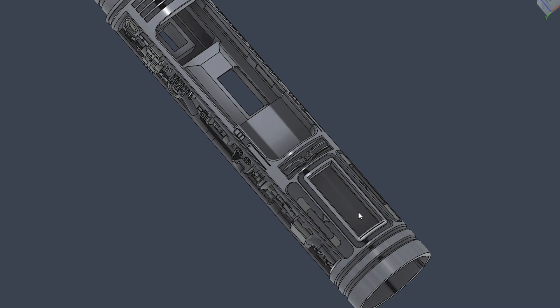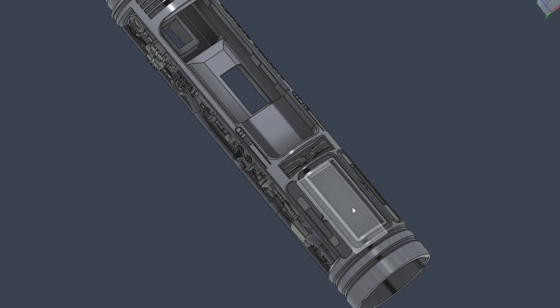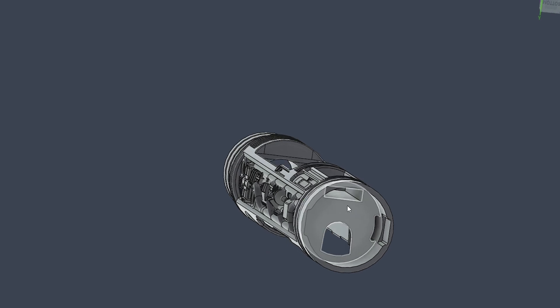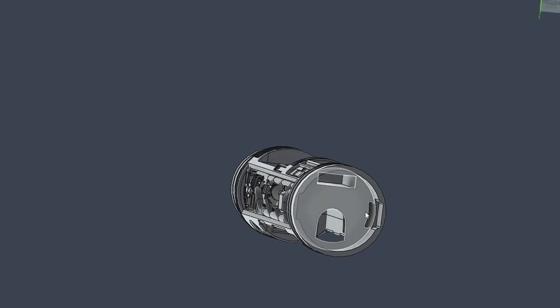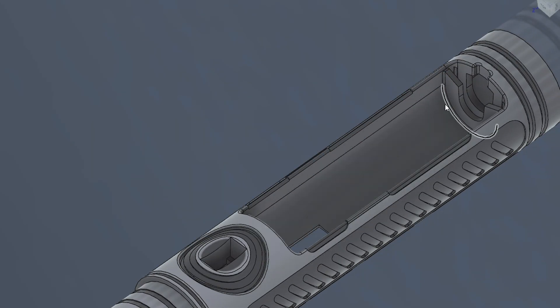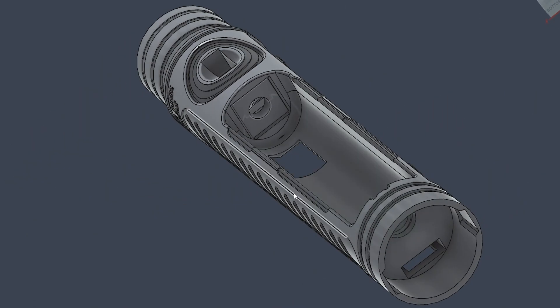Up top — and down at the bottom we've got an OLED. I believe I put a blue OLED in here. It's underneath the chassis and the leads come out the bottom, so I wire up the OLED and then slide it into the channel. There's a 28mm speaker from Smuggler's Outpost down here. The CFX board sits in this tray and slides up underneath this lip to help secure it. Around the bottom we've got a kill switch, and the battery tray is here.